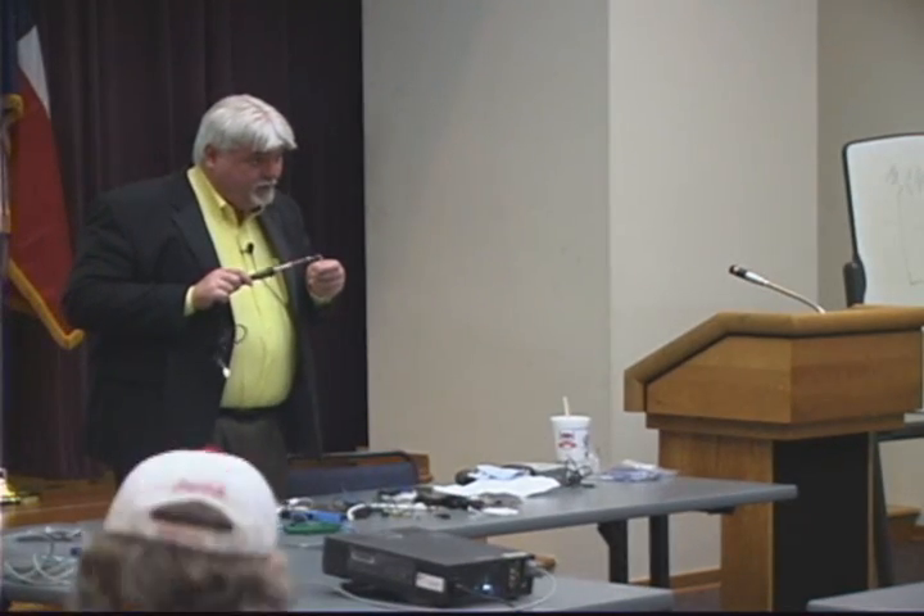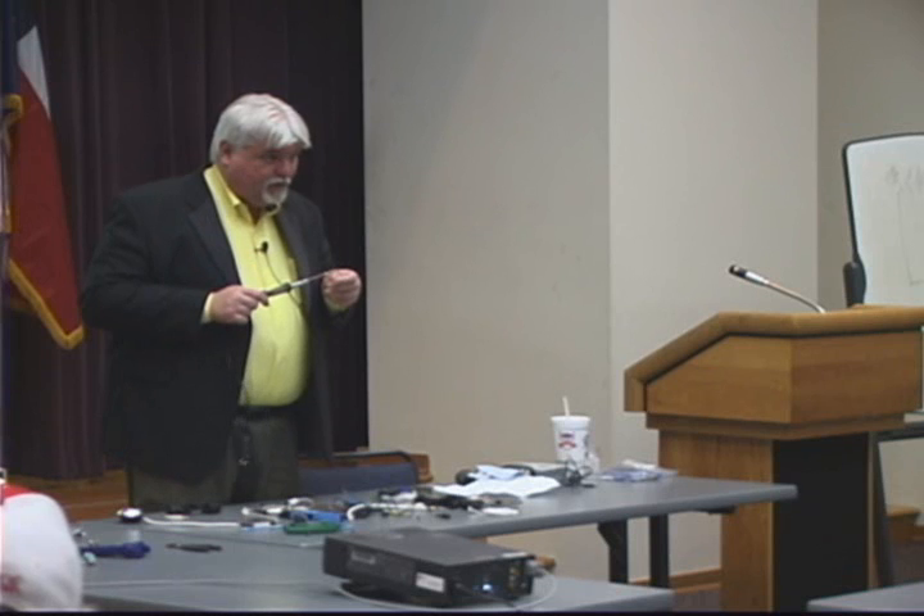We're going to do some demonstrations on soldering — a breakout on soldering using our soldering iron. One of the things people do when soldering is they tend to peck on the surface they're trying to solder. You want to get it hot so the solder flows. Touch it to the surface, and the solder should flow very quickly like water, because it wants to make a metallic bond to the atoms of the copper or the other substance.